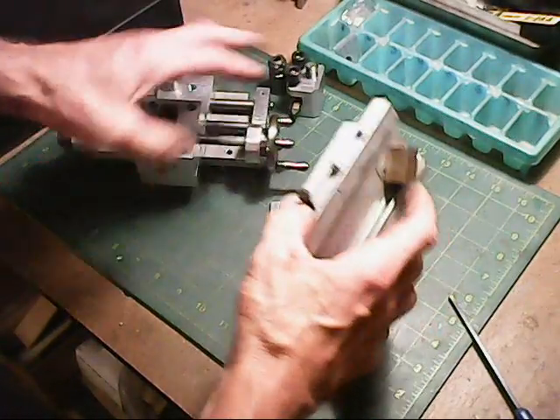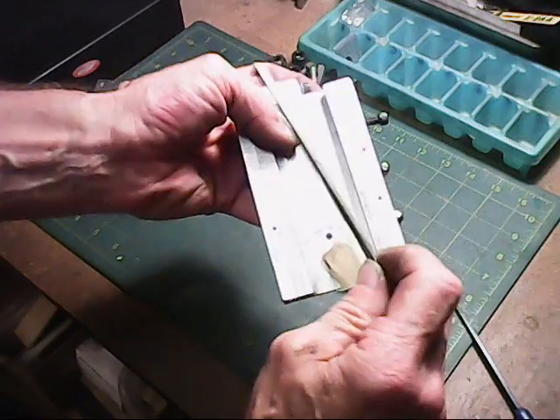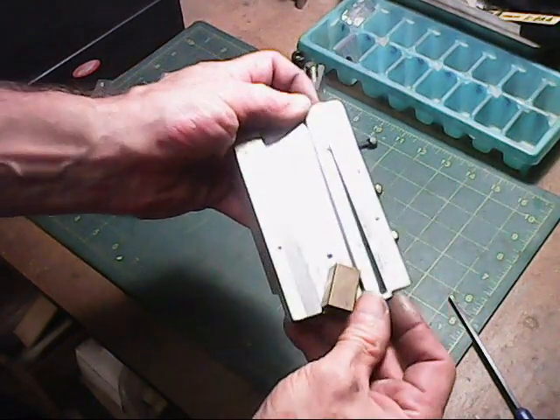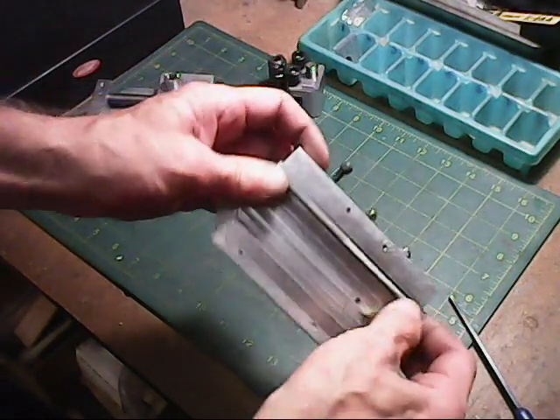I also make all my Gibbs this way. My Gibbs are made like this, where they have two edges here, so I can just slide it over the dovetail like this and then just set it in. That Gibbs is only aluminum, and I just set it in like that.